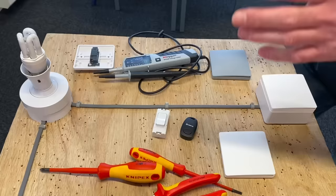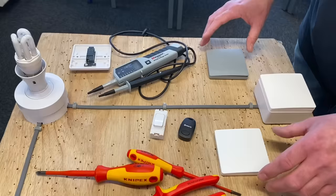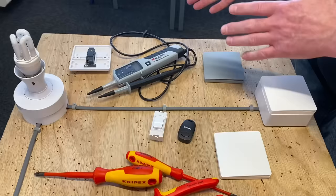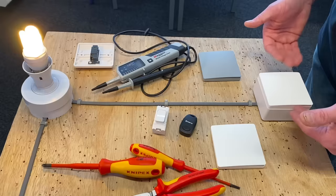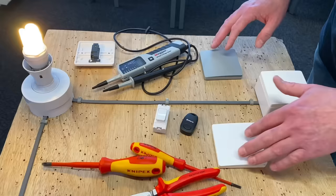At college you're taught one-way, two-way and intermediate, and it's vitally important you're also taught the two-plate, three-plate and wired-through-the-switch methods — we've shown all of those on the channel. But out in industry there's nothing stopping you using a system like this to quickly upgrade a bedroom or any room: you move your bed around and the switch isn't in the right place — just change the switch at the door to an inline receiver and introduce up to five additional Quinetic switches with no wiring or batteries required. I hope this video has been some fun and some help.